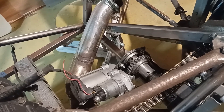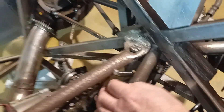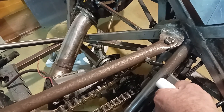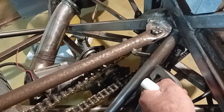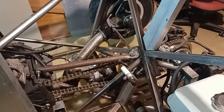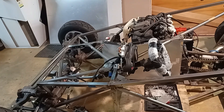I've got away from the crazy pivoting reverse idea and I'm using a jockey wheel that comes down onto the back of the belt by pushing down on this lever. So now to reverse — as soon as this moves, it'll engage the reverse motor and effectively clutch the belt onto the front and rear pulleys and move the car into reverse. I think it's safe to say that's a voilà for that apparatus. With a decent sized battery with a bit of kick to it, I consider that a success.